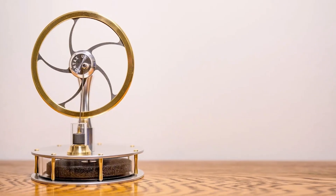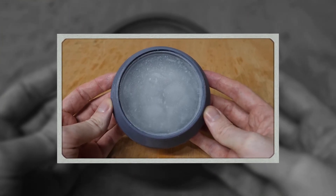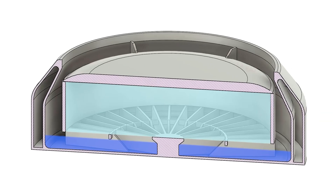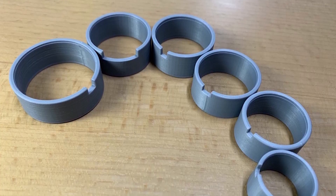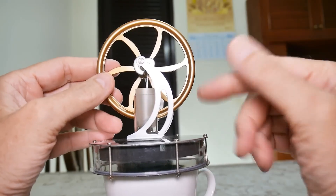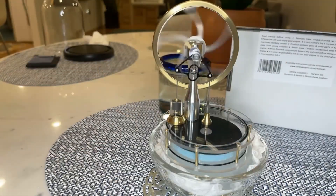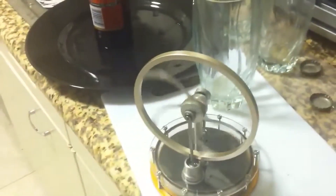A simpler approach was followed. A new version of the design turned the mold concept upside down — the ice could be frozen inside a cup that doubled as an insert for the tray. Once frozen, the cup could be flipped and mounted upside down on small pegs, allowing meltwater to drip down into the cavities below. On paper this seemed ideal, but in practice it wasn't. Each test cycle took almost a full day: hours to print, hours to freeze, and hours to test. The first trial with this setup yielded disappointing results — only four hours and 51 minutes of runtime, over an hour shorter than the earlier record. The data showed that performance had decreased as the designs became more complex.